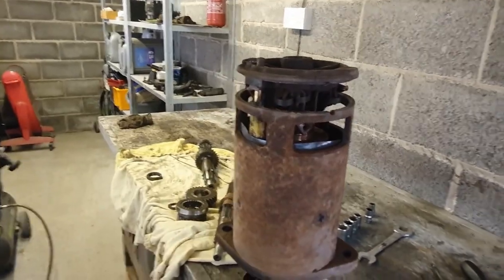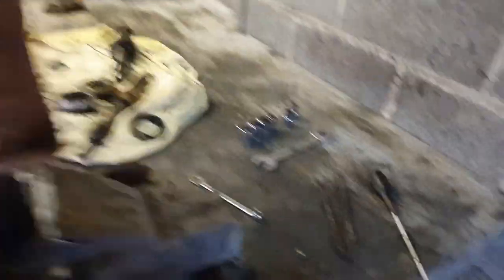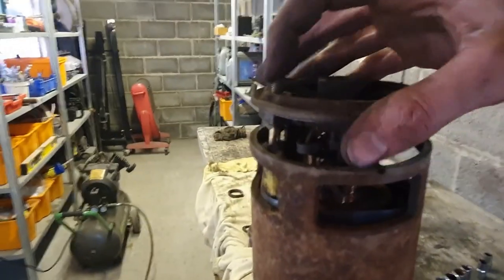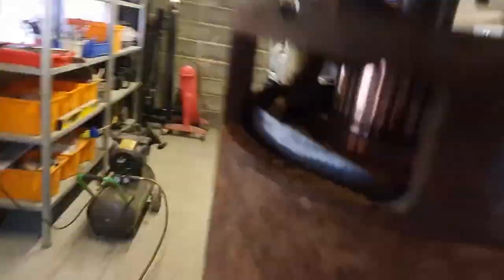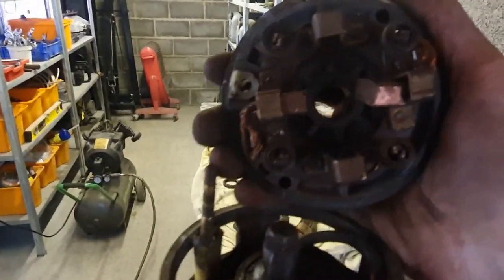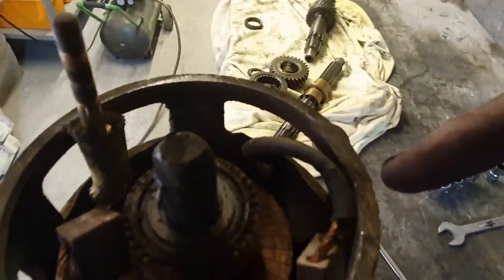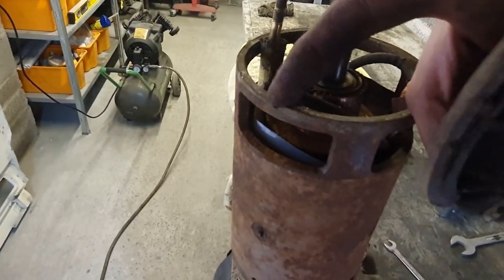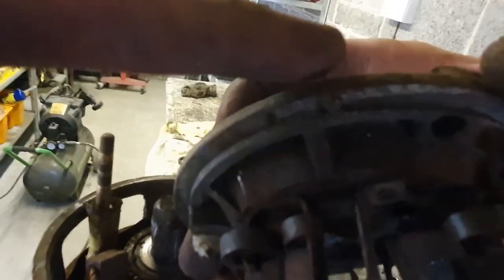In the usual fashion I got stuck into it and I didn't do any videos. I've taken all these nuts off, which is where you connect the positive, which means I can then pull this top off. Two of the brushes stay behind but you can see there are two slots here and here where those two brushes go. And it can only go back one way because there's a slot in the housing here and a notch in the top there.